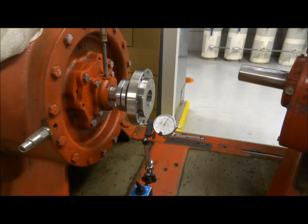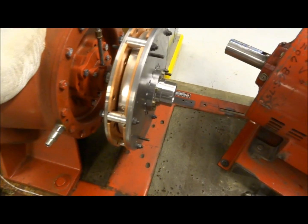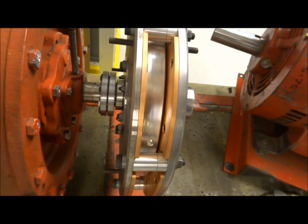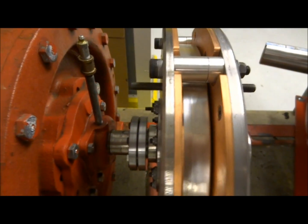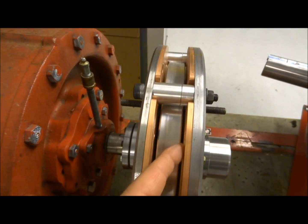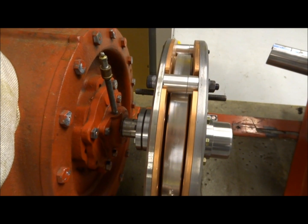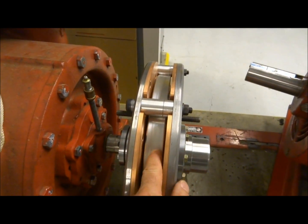At this point I'm going to install the coupling on this hub. The coupling is now installed on the load side hub and all of the hub coupling bolts have been torqued. This would be a good time to point out the jacking screws — those are what maintains the gap, that eighth-inch gap between the magnet rotor and the conductor face. This is about an eighth of an inch gap. When the coupling is all assembled and bolted in place, those jacking screws get removed and then this conductor moves independently of the rotor.